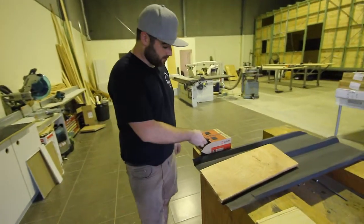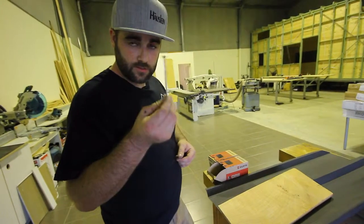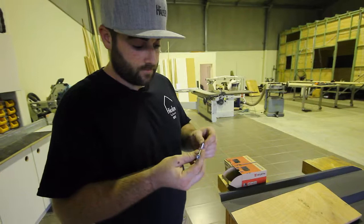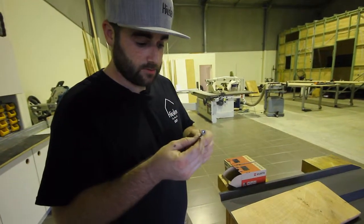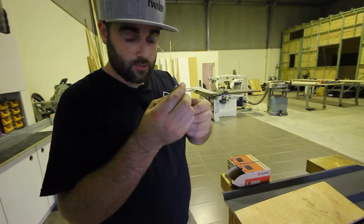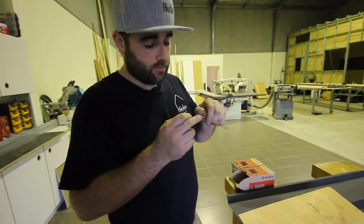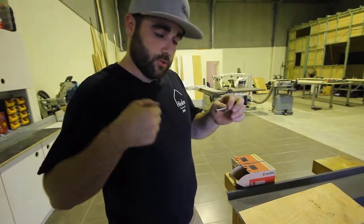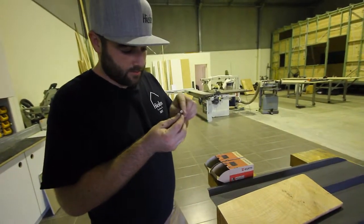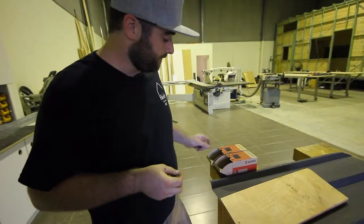The last thing to point out — we use these screws for most of the structural work. The brand is Würth, and they're really beautiful — like a piece of art almost. They look like stainless steel but are actually galvanized and rated for exterior use. When you normally see a galvanized or zinc coating this smooth, it's usually not for exterior — but these are, and they're just that well made. The thread is really nice and sharp, they're extremely strong, and the drive system — which I believe is unique to Würth — means you have to buy the bits from them. It's very reliable, no breakages, and you don't get much bit fatigue because you don't have to push hard. We also use their smaller screws for all our cabinetry.